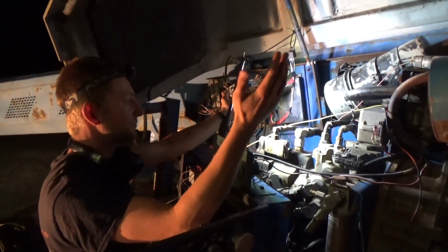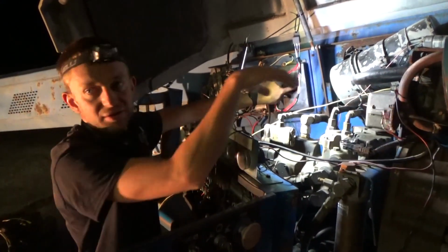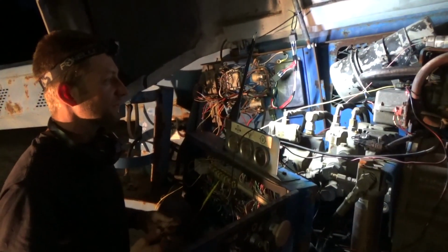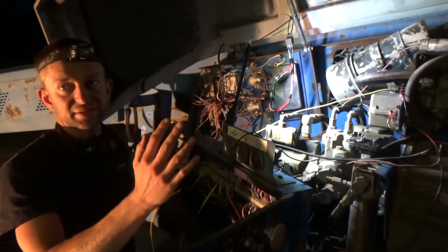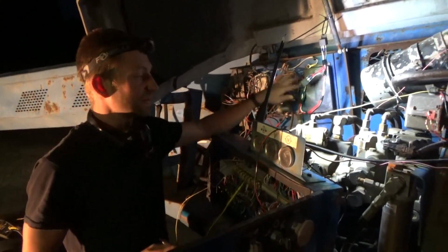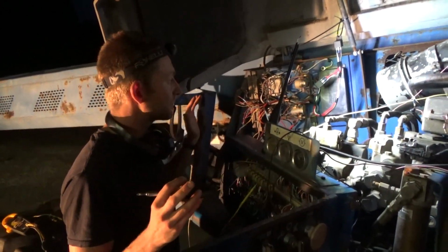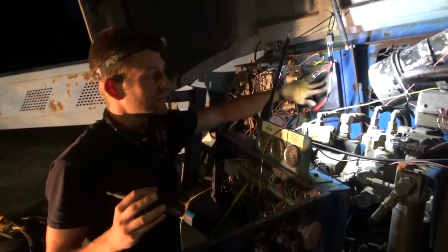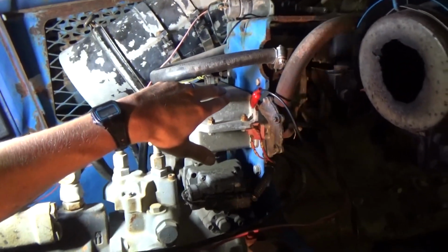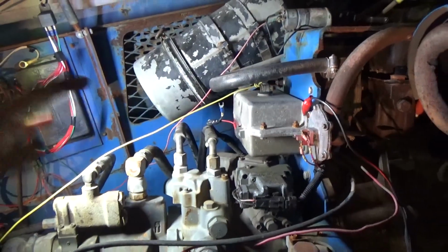Why did it burn up? I don't know, but 5 amps, I mean, that's significant for a transistor driver, right? Yep. That is pretty significant. If it was like a big switch and a relay, then 5 amps is nothing. But going through a smart box that's expensive, I don't know. But in any case, it starts, it keeps running, and we know the box is good, right? Yep. So the only questionable thing is this mechanical governor, and we measured the amperage draw, and it's 5.4 amps. Correct. Full field. And that's all the information we have right now.